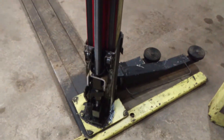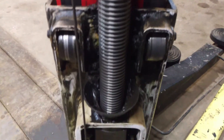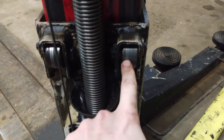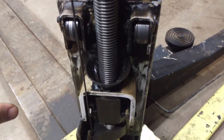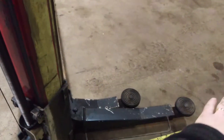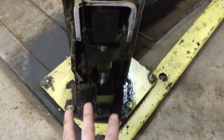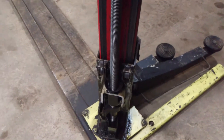There we go - red and white, that was the colours. You can see in here where it's still red, so whoever painted it did a really good job. Here is the carriage. You've got the main lift screw, a cable - I'll explain what that's for in a minute - and rollers left and right. Because this is an asymmetrical two-post lift, most of the car sits over the back - hence the reason these arms are longer. Most of the weight is supposed to sit over the back, so basically a lot of the weight will come onto these rollers if the lift is set up correctly and it's on level ground. The guy I bought it off hadn't set it up correctly and it wasn't on level ground.